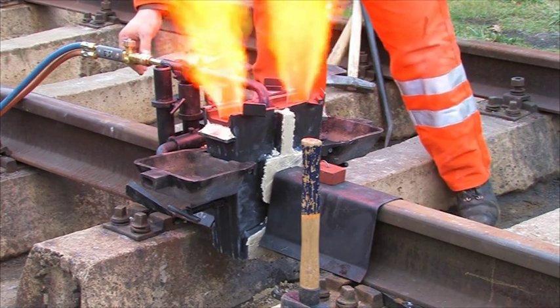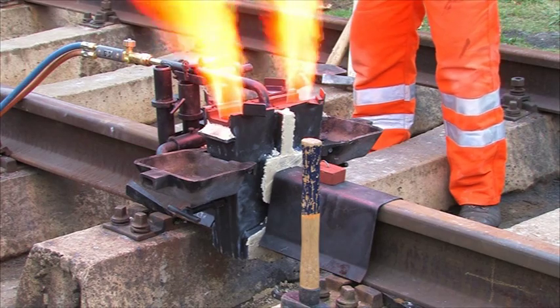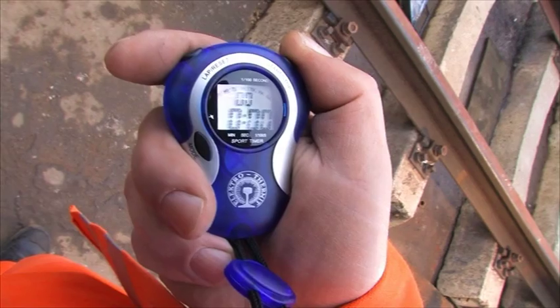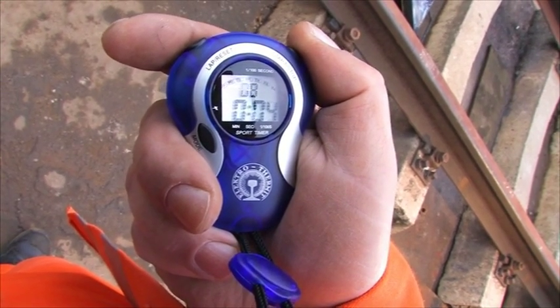The preheating runs by neutral flame. Both flame cores over the molds should have the same length as well as the correct height. Only now starts the preheating time given in the Code of Practice.